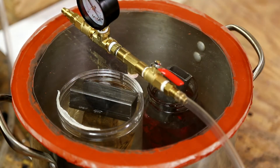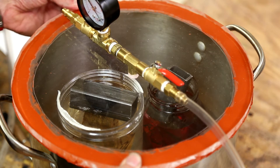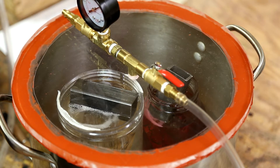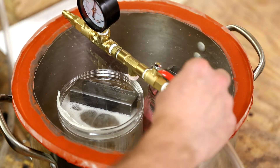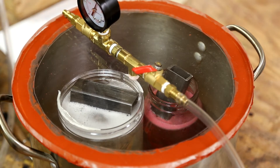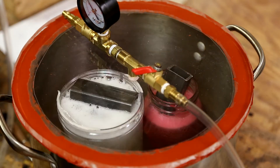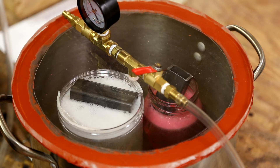From this valve, turn on the vacuum — let's see what happens here. I don't want it to froth over, but I want to get as deep a vacuum as I can to get all that air pulled out, and I just need to be patient.